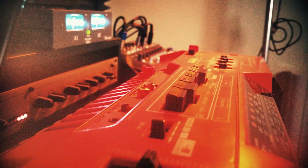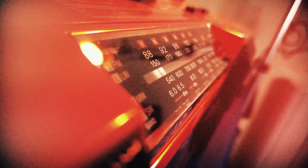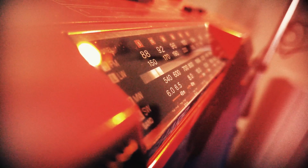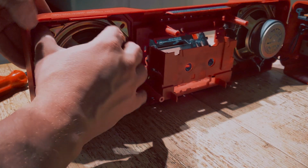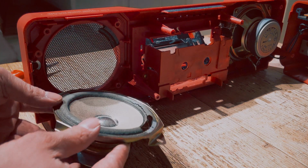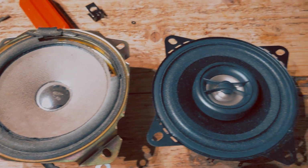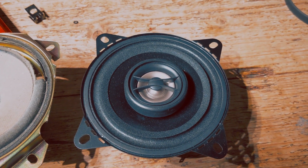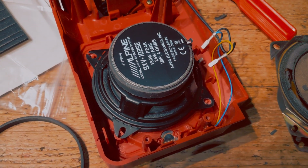If you're retrofitting one of these units, you are going to have to make some compromises with the speakers, because you can take all the speaker measurements you want, but all these units, while they're going to claim they've got 10 inch speakers in them, all the mounts are going to be very slightly different, and certainly the depths are going to be slightly different again from the original units in here. All the speakers you buy are for car hi-fis, and there's lots of space behind in the door cards and so on to put all the bits of speakers you need.